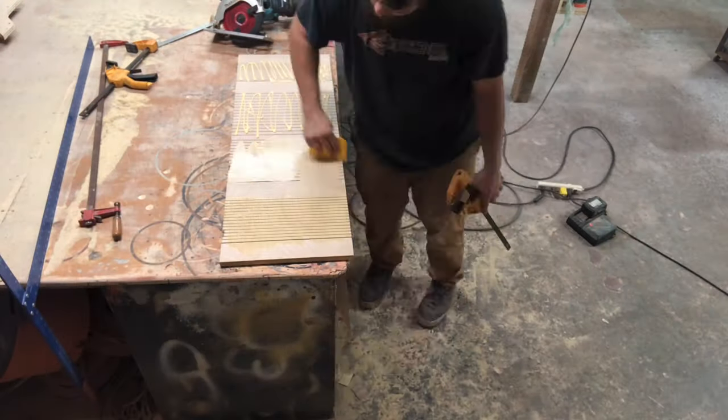It can happen. I guess it's a good way to show you guys that you can break them if you clamp too hard. That brings us to a very important tip. Do not overclamp them when you're clamping them together. As you see for the example, I only have clamps on one side. I highly recommend if you're building an enclosure or doing something with a KERF, clamp it on both sides for it to dry, because you want it to dry as square as possible.